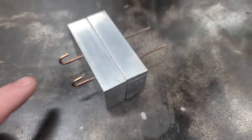Look, if you're going to pour lead, then you need your PPE on. You always need to wear PPE when pouring lead. Get you a good respirator. Next, you're going to need some safety glasses. And you're probably going to need to wear a weld coat. Next, make sure you got some good gloves. Now, safety glasses protect your eyes, but they don't protect your face. So get you a weld helmet. Now we're ready.